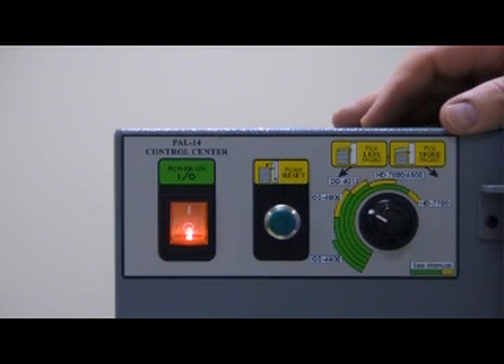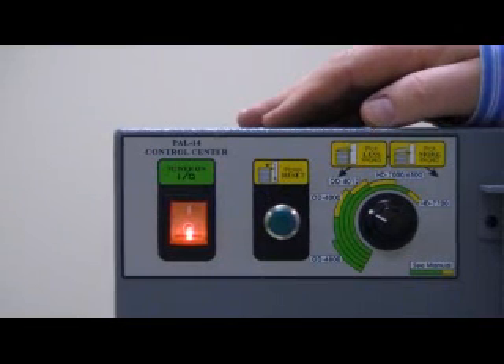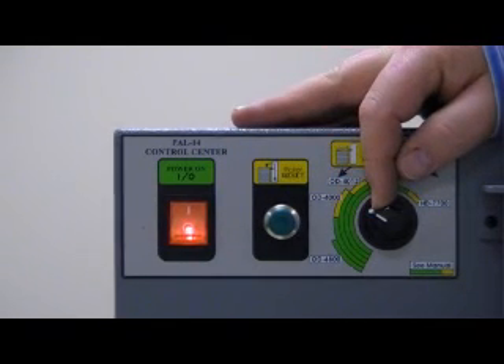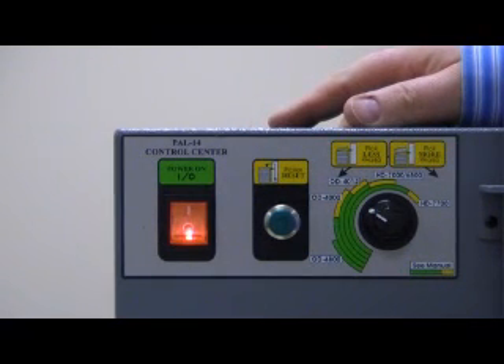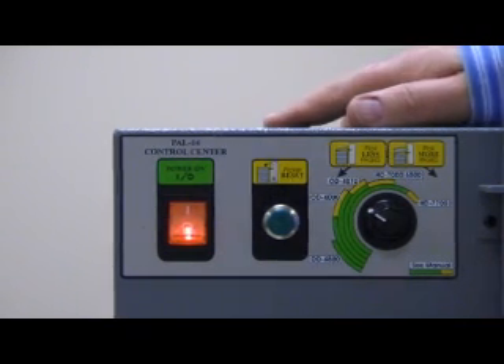Generally, I would tell you to keep it on the lower side rather than the higher side — you'll eliminate any punching problems. The advantage of the Pick-A-Lift is it will pull the same amount of sheets at any given time. If you have a 7700 and an operator that punches roughly 20 sheets, then 25, then 15, then 12, then 18, they're inconsistent. With the Pick-A-Lift you set your stop and it doesn't count pages — it measures the height of a stack, and within about two or three sheets it's going to pull the same amount of paper every time.